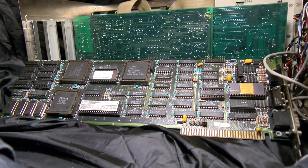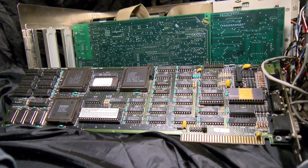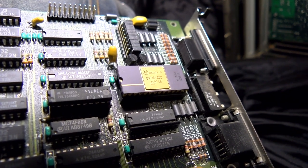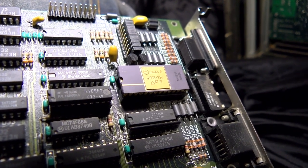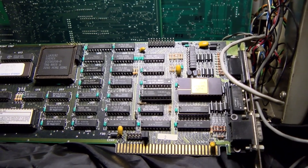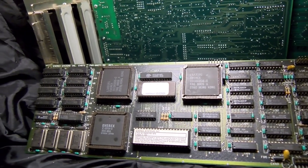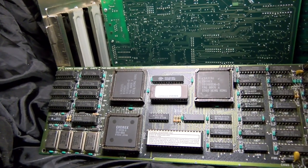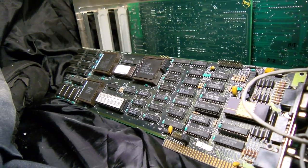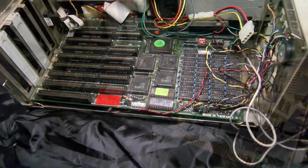Using a VGA card is by far the simplest solution most of the time. VGA cards are a lot easier to find because they were made for a much longer period of time. It was the standard for so long that most cards and monitors will work with at least some version of it. Most VGA cards can even display CGA and EGA on a VGA monitor — they'll do the digital-to-analog and scan conversion for you, and most applications will have absolutely no idea that anything is wrong.